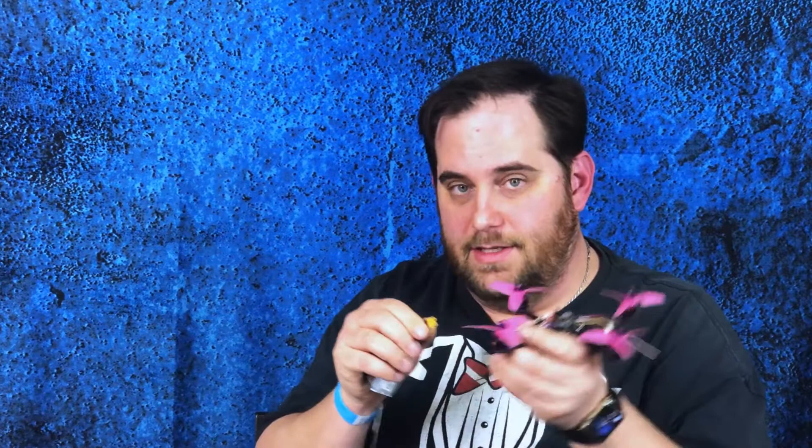This is the gyro chip in question for the reflowing. I took my flux paste with a toothpick and went all around the whole perimeter of this little chip — you can still see a little residual of it. Then I used the hot air gun blowing straight down on it, holding the wires with a little tension. Once those wires pulled out, I knew the solder joints had softened and liquefied — so the solder joints around the perimeter of this chip had to have liquefied too. I immediately removed the hot air gun, let it all cool, then reattached my wires. I tested it and it works perfectly fine — no more no gyro problem.